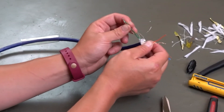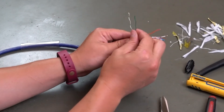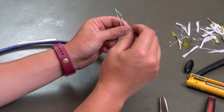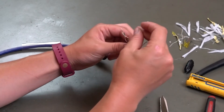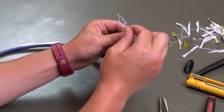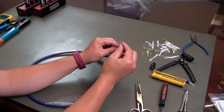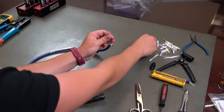For what we do: broken-up green, solid green, broken-up orange, solid blue. We kind of put these in our basic pattern. Broken-up blue, solid orange, broken-up brown, solid brown. So now that we kind of have it vaguely in the right position, we take our little tray.